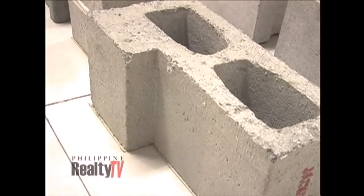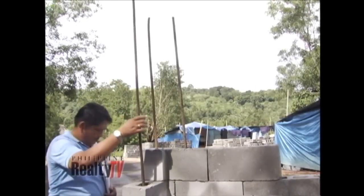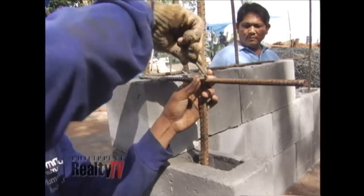They replace the need for conventional posts. In short, you can build a whole house without having to cut any block because we produce them in all the sizes necessary for building a modular house. When it comes to installation, these blocks only require partial grouting on cavities with vertical reinforcement.